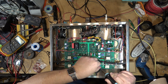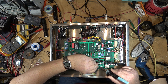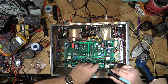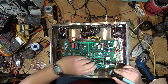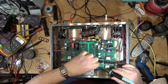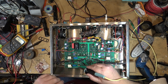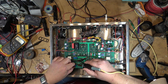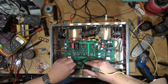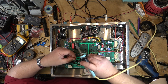When running tests and checking voltages, I found the voltages were creeping up a little bit too high on the left channel, so it's time to see why the left channel is out of balance. We're swapping out four caps and putting in four new higher-rated ones. Three of the original caps were rated at 250 volts and one at 400, so one had already been changed in the past, as had the four white coupling caps to the output tubes. Now we're doing the pre-driver coupling and blocking caps.